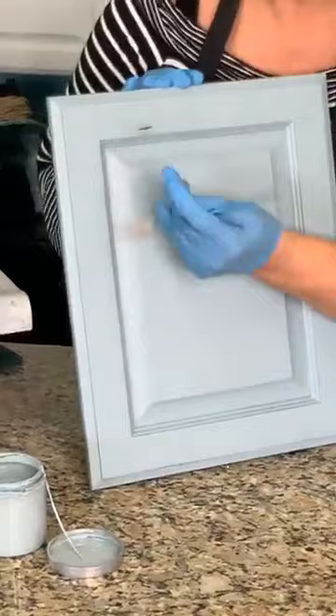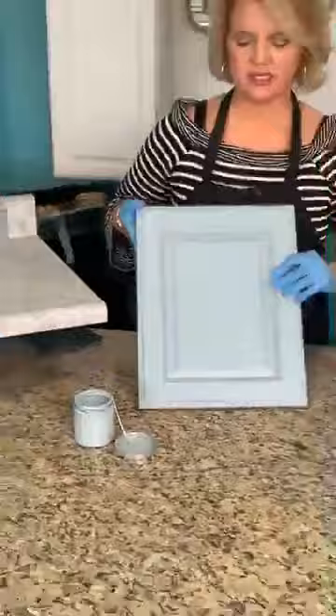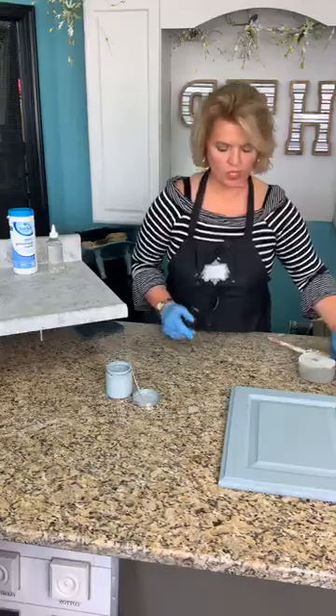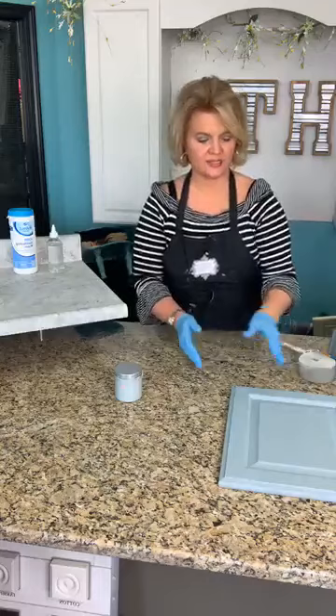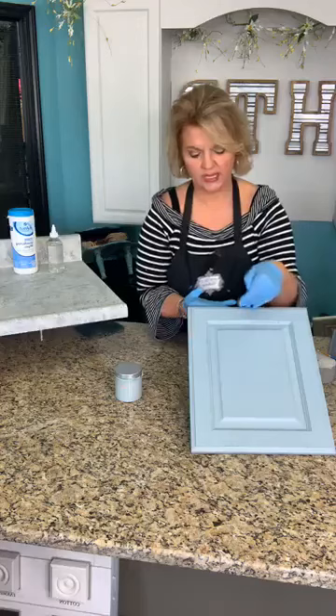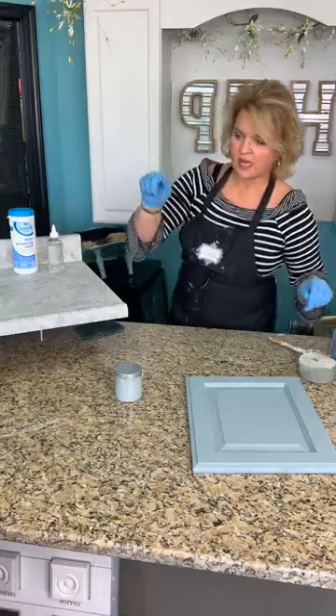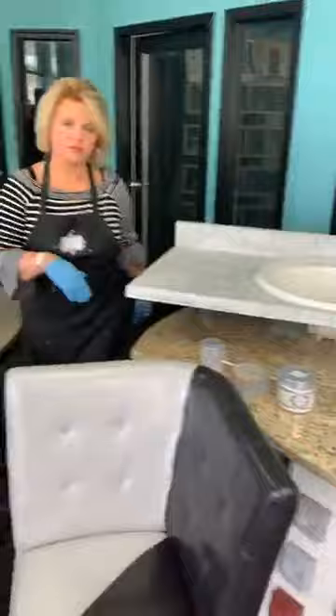To touch up, get your little artist brush and go in to get everything to one tone first. That spot will probably be visible when dry, but we just want to get everyone up to the same color. We'll let that dry, then come back. We'll apply a coat over the entire surface, because if there was a light spot and you just covered that area, the rest of the door would have two coats while that area has one — you'd always see it. So get it to one tone, then go back over with a true applicator and one more coat.